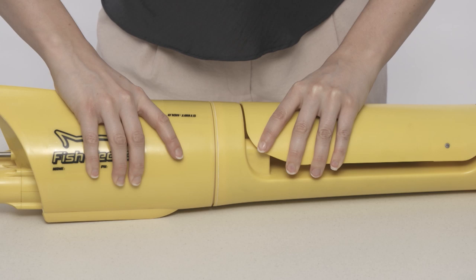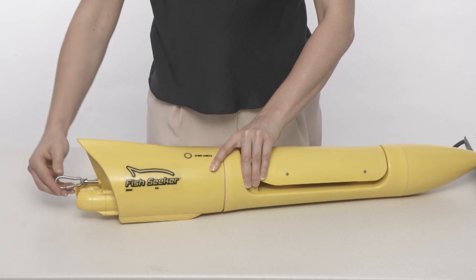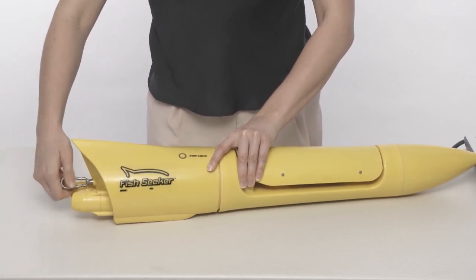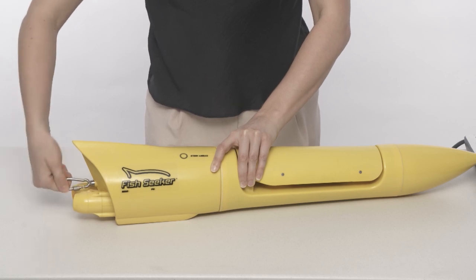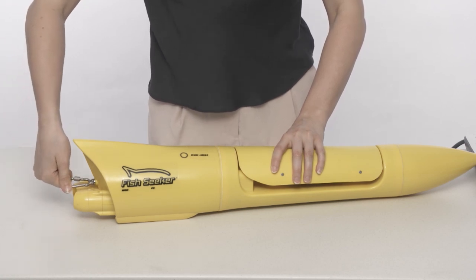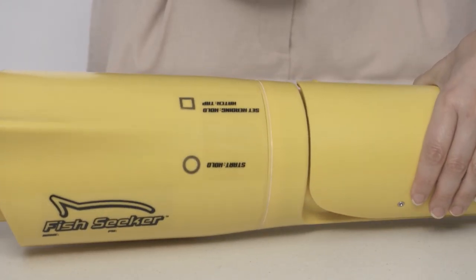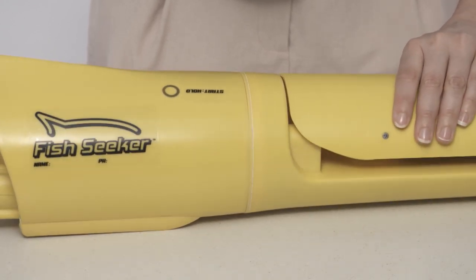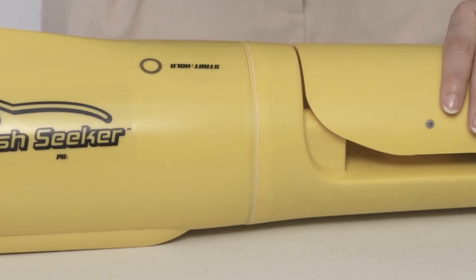Bring the openings of the front section and rear section together, ensuring the flat sections at the bottom of both hull sections meet. It is critically important that the seal is clean and free from sand. Do not open or close the Fish Seeker on sand. Always open and close the Fish Seeker on a sand-free surface, like a towel or a chilly bin. Ensure the front and rear sections are sealed together and watertight by screwing the tie rod at the rear of the rear section. Do not over-tighten. Tighten only until the faces are just touching. Continue tightening until the gap closes in at least one place. It is normal for a small gap to remain in some sections of the sealing faces — as long as the gap closes in some areas, the seal will function properly.